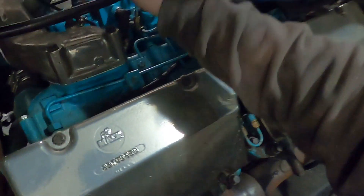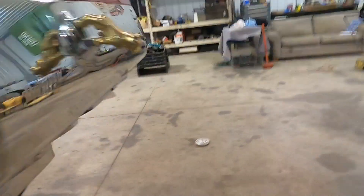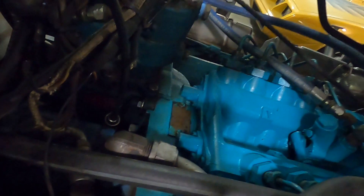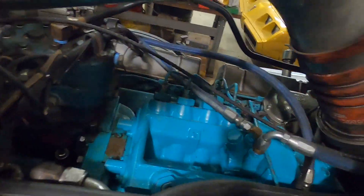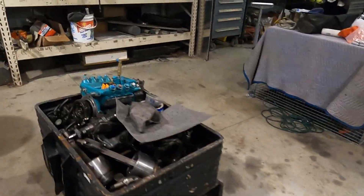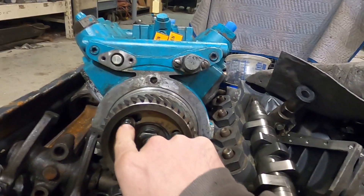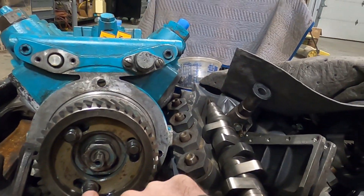This cover here covers the front of that hub on the pump where you can see the hole. There's a plug down in behind the tach - a pipe plug. You pull that out and you can get a socket in to get to the bolts on the front of that hub. That allows the gear to turn separate of the drive hub.